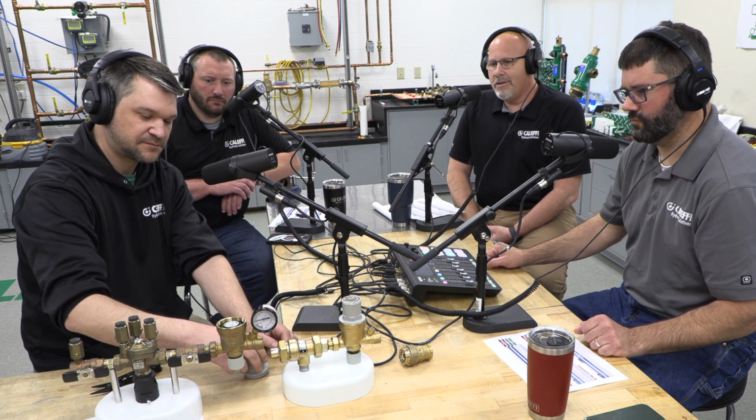Yeah, it's pretty nice. Greg, you had mentioned that in some systems, especially a sealed system, it may be years since water runs through the device. But being an autofill, I think we did another segment on air separators. There's always oxygen in your system. So as that air separator pulls that oxygen out, the autofill is going to come back in behind it and maintain pressure in that system. Right. Yeah, which is good, but it also brings up another topic of debate. Do we leave it on in autofill mode, or do we fill the system, get everything good to go, work all the air out, and then shut it down?